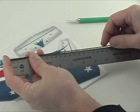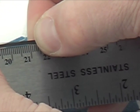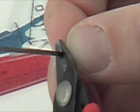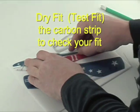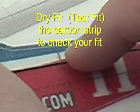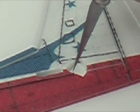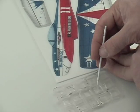We're going to insert this carbon strip into the fuselage, making a composite structure. Cut your carbon strip to 212 millimeters and then do a dry fit of the carbon strip in the fuselage — just lay it in and see that it's the correct length. If you cut it to 212, it should end right here.